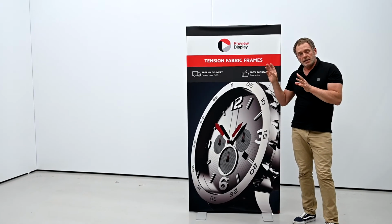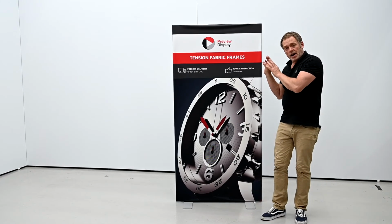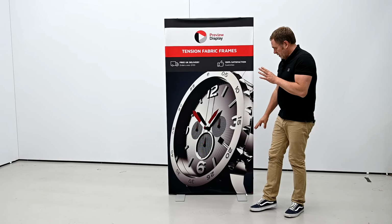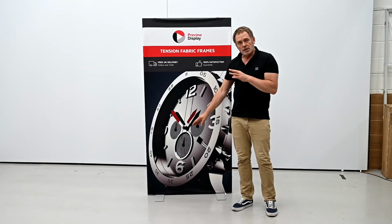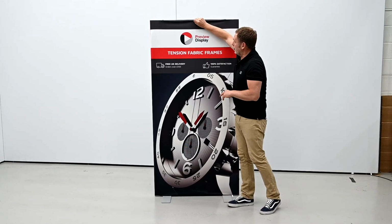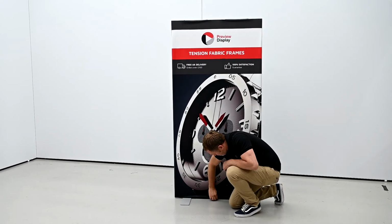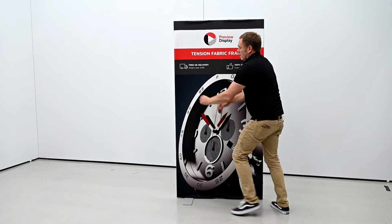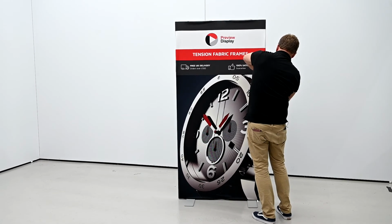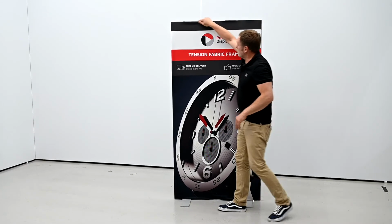We always fit the four corners first of all, and there's a reason for this: we actually cut these graphics undersized to a precise formula. So, by fitting the four corners, you make sure that the fabric is stretching out to the correct size. Having fitted the four corners, we fit the middles of the graphic. Top, bottom, left, right, and then finally the quarter positions, if you like.